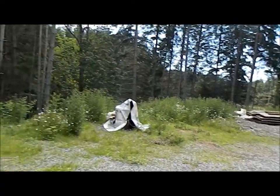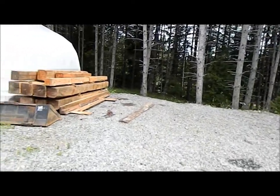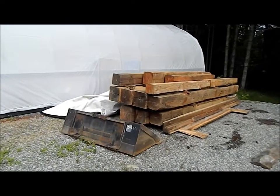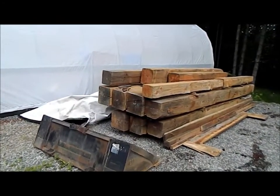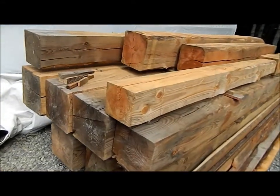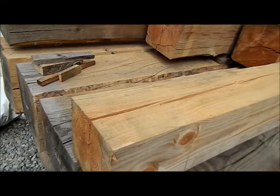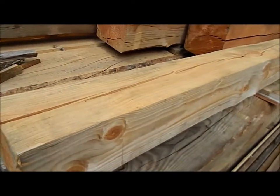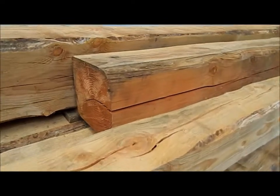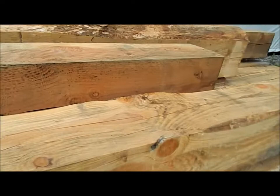So for the rest of the trees when I cleared a little more here to make this parking lot a little larger, I thought I don't need the lumber right away and I can't leave the logs raw like that — so I'll cut them into cants and then cut the lumber as I need it. These cants have been sitting here under the tarp for probably six months and it's wonderfully dry, but you see all the checks in it all throughout everything — it's not just the ends, it's all the way through.